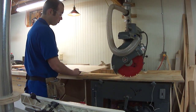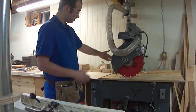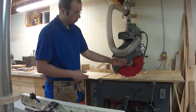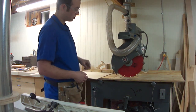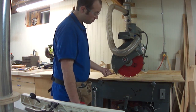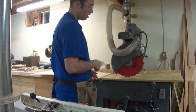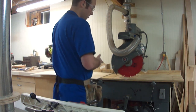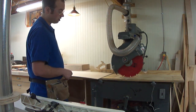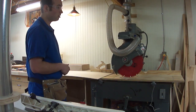It's time to rip down the quarter inch plywood bottom for the drawer. Because it's ten and seven-eighths inches wide, I've switched the saw over to its out-rip position, which means the blade is now facing away from the fence and the motor is facing in. Because I've rotated this saw 180 degrees, I have to feed it from the other side — because again, the blade rotates this way, I have to feed it opposing the blade. Otherwise it could just grab it and throw it out the other end, and that would wreck the workpiece and the wall of my workshop.